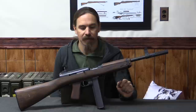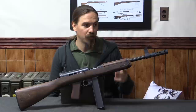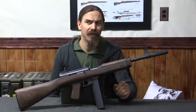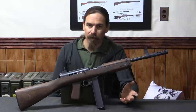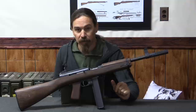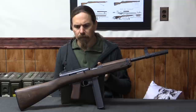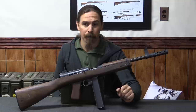The Marlin company got the manufacturing contract, since Inland was busy with other projects — they were able to help Hyde with development but didn't have the factory floor capacity to produce the guns. The contract to manufacture went to the Marlin Firearms Company for 164,450 of them, with deliveries supposed to start in December of 1942. The problem was Marlin had trouble tooling up. About half a dozen parts were intended to be made through a metal sintering process — taking powdered metal and compressing it with very high heat and pressure into complex forms — and the manufacturing dies ended up being far more difficult to produce than anticipated. By spring of 1943 they still hadn't delivered any guns.